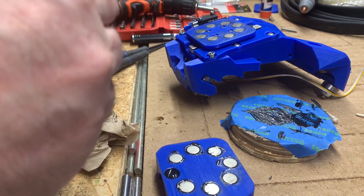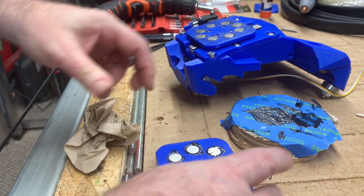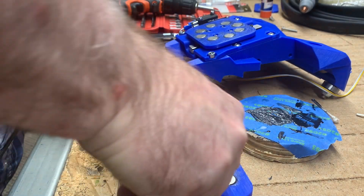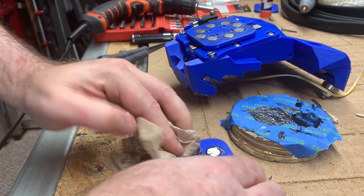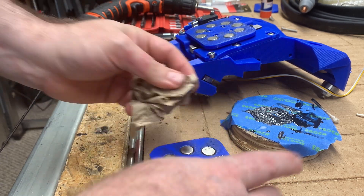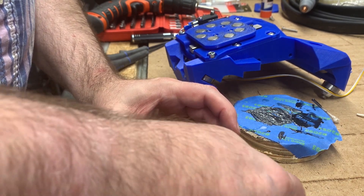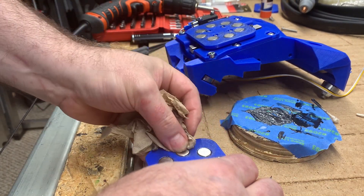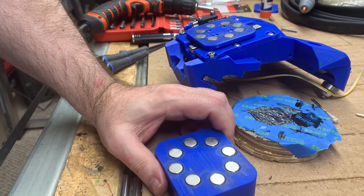This particular phase of the job is no time to be drowsy or asleep at the wheel. You need to be very careful to make sure that you put the magnets in facing the right direction and that you put them in the right slot corresponding to the way that they were attracting each other on the other set of magnets. If you mess up on that, you will ruin the part — because once that glue sets, you probably won't get that magnet out without destroying it, and you'll probably ruin your 3D printed part in the process. Ask me how I know.